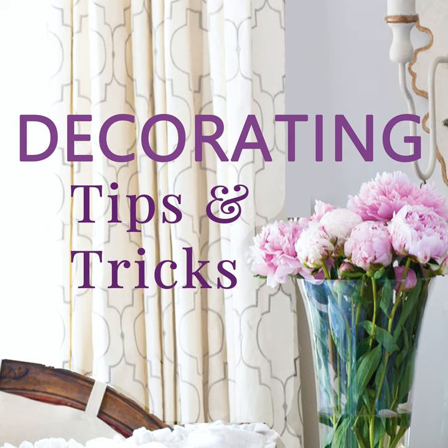With chalk paint, you don't necessarily need a primer — that's one of the great things about it. It's one step. And if you chalk paint, you don't always need to put a wax finish on — you can leave it as is, depending on how you're going to use the piece. But wax does protect the finish a lot better, especially if someone might put a glass on it or it'll get dinged.